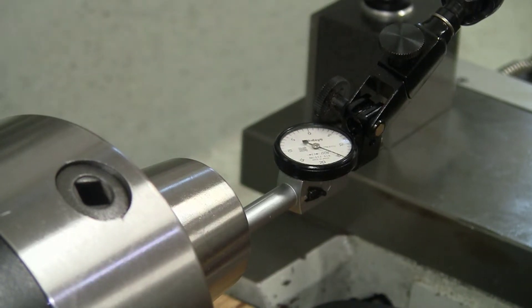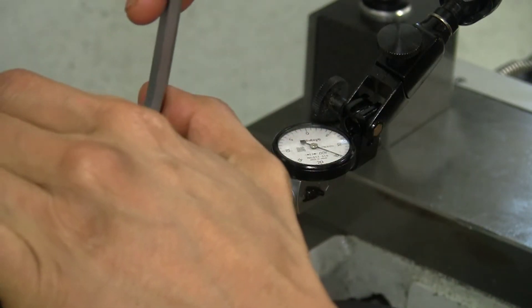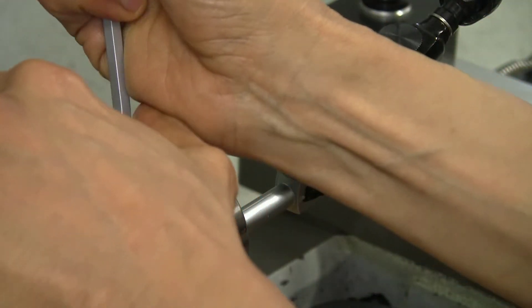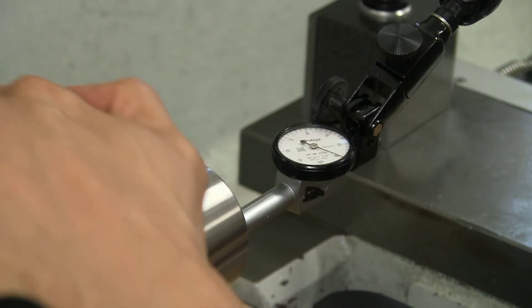This time I thought we would loosen up the face bolts and then tighten them up slowly and steadily — doing very little, perhaps a sixteenth of a turn at a time — and watching what happens on the indicator. And much better.